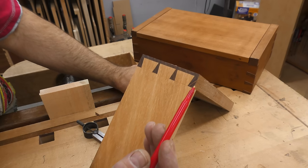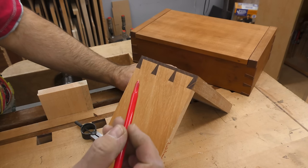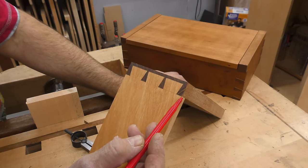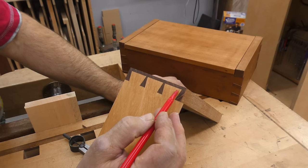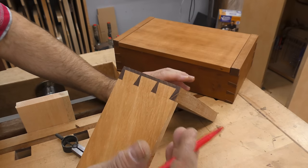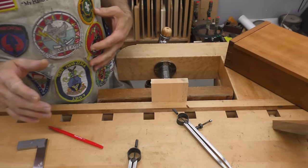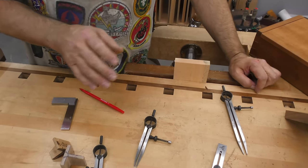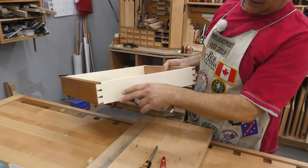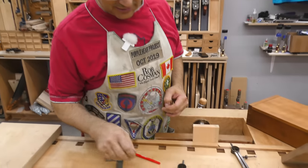That's a tough one to master. I tell people that's something you just have to practice - keep all your practice pieces, date them, and look back over time to see how you're doing and how you like it. I typically end up somewhere around a quarter of an inch at this point, because it's all done through the layout of the tail. Anytime you see my dovetails, they're always symmetrical. I don't do the big ones on the inside and little ones on the outside. I like them perfectly symmetrical - that's just the way I am, and that's what I'm going to teach you.